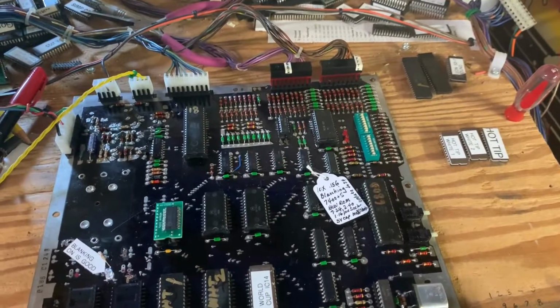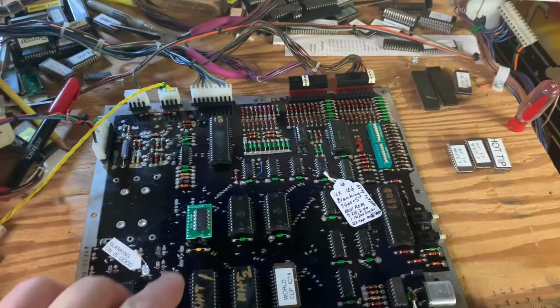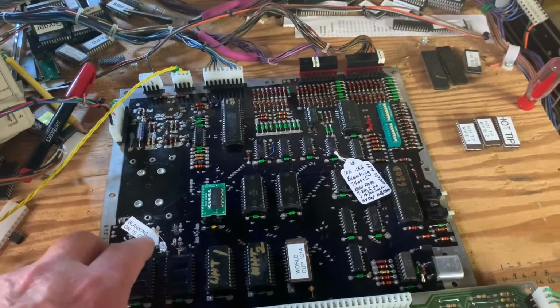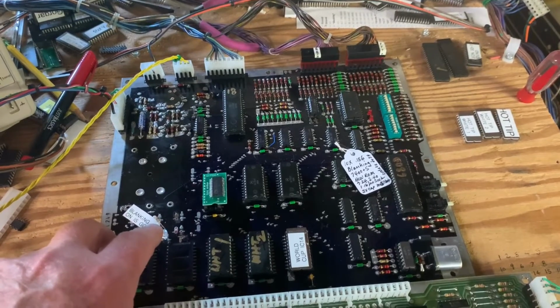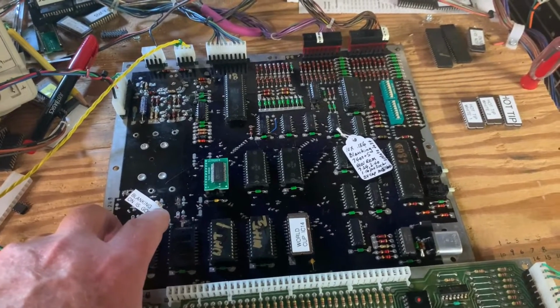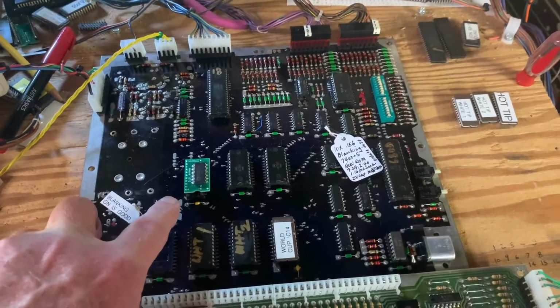When I first got this board, when you did that, the 2 LEDs would lock on, and the problem was that there was a 5101 here, which I originally tried to use a super cap to back up the power for, but the 5101 was bad. Even though it would pass in my Neolock tester, it was in fact bad. So after I fiddled with that for a while, I just said, the heck with it, we're just going to put NVRAM in, and that is what I have done.